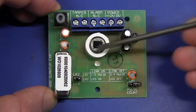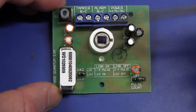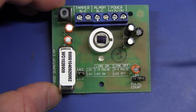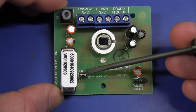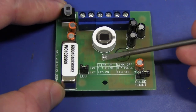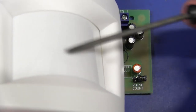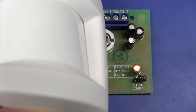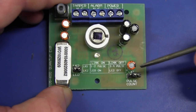We have our PIR sensor here, and we have our relay over here — which we'll look at in detail because the relay is actually quite important. We've got a couple of jumper switches. One is to disable the LED. If you don't want it to come on, it just shines through the front of the case here through the Fresnel lens — it's not transparent, but you'll get a nice dim glow around there. We'll power it up later and see that.